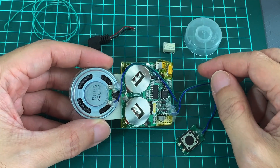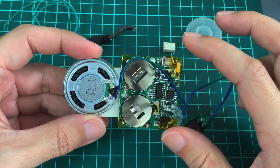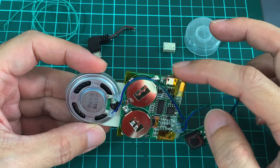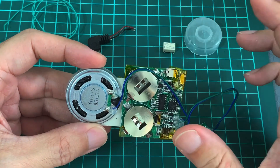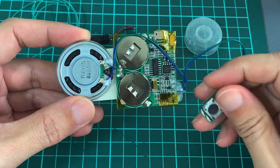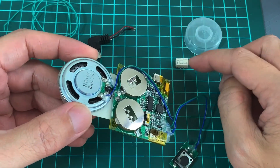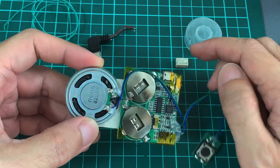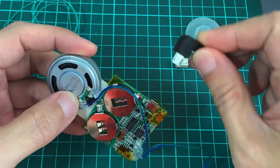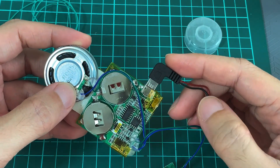To spice things up further for the Nerf target board, I found this interesting sound system whereby you can hook it up to a computer and upload your preferred MP3, so you can have any sound effects or song you like. It's triggered by a push switch which I will replace with the same 5V relay, controlled via our Arduino. Instead of using the button batteries, I will be using a micro USB, and this way we could hook up 5V from our regulator.